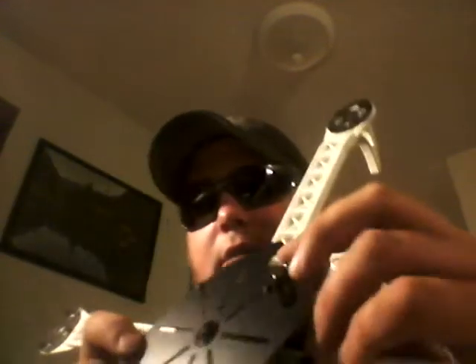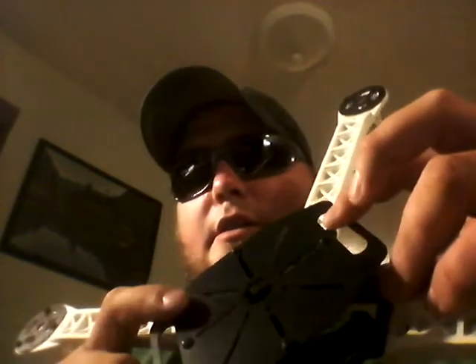The standoffs are plastic and the nuts are plastic. When I started tightening them I didn't really think about it too much - I over-tightened one and started stripping it out. What I ended up doing was taking super glue, coating the threads, slapping it together, letting the super glue set up, and making sure it was tight enough but not over-tight. There are metal screws going into a plastic standoff - I don't know if Horizon was just a little bit lazy in that regard.